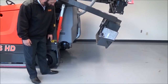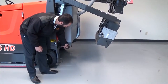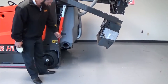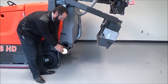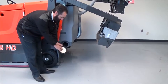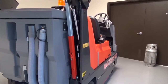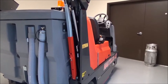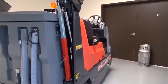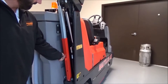By lifting the hopper up and out of the way, we access the recovery drain cap for washing out sediment from the bottom of the tank. Simply remove the cap. This will allow the operator to wash the debris from the top of the tank and out of the bottom. The recovery cap has a gasket inside to seal the tank so it will not leak — it has to be placed back in correctly so that it will seal the tank. When the hopper and the squeegee are in the lifted position, we have two safety pins, one located on each side, that can be put into place so that you can maneuver underneath the lifted hopper and squeegee safely. Simply lift the clip out of its retainer and engage it into the hole above — one on each side will protect you while underneath the machine.